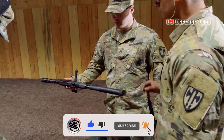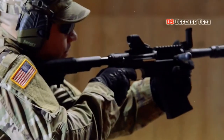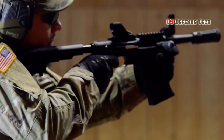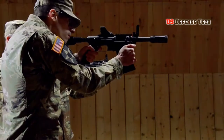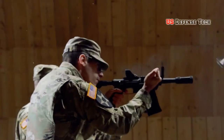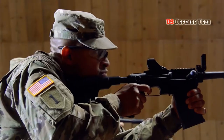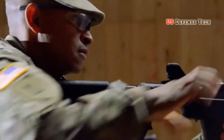The Army called the new rifle the M16, but fatefully changed the gunpowder used in bullets issued to soldiers. The M16's direct impingement design channeled some of the gunpowder gases into a metal tube that ran back into the weapon's receiver, pushing a bolt carrier group, ejecting the spent brass cartridge, loading a fresh cartridge, and firing the weapon. The gases tended to channel gunpowder residue into the rifle, increasing the need for cleaning.